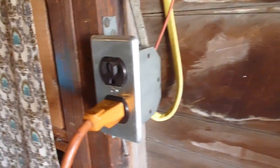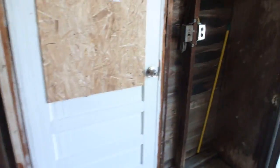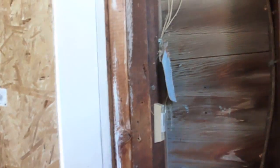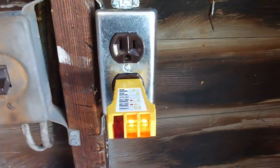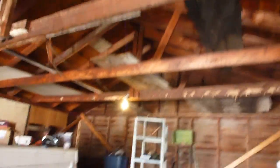So I just took that, hooked it into everything here, hooked it into the ground and all this new wiring. Everything's grounded now. As you can see, there's no ground wire in this cable. This is my outlet tester — you can see there's a ground on there now; both ambers say correct for ground. Right now I haven't wired that outlet up yet with the new wiring, so there's no ground on that outlet yet, but we're going to change that today.